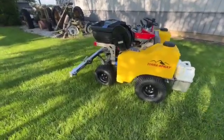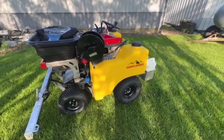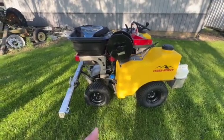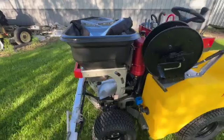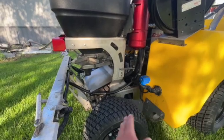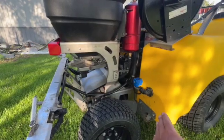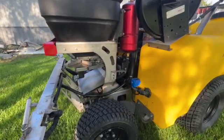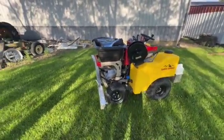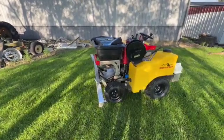Another thing they do is spray. They've come out with two pumps, three pumps, alternators — all these different things to get you the volume to run all liquid. This machine has a pump mounted to the very bottom of the machine; it's clutch-driven and basically gravity-fed, so you're never going to starve that pump. Whenever you put your water in there, it automatically starts feeding that pump. And for hillside stability, you're always going to have water coming to the lowest point of this machine.